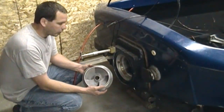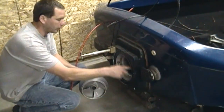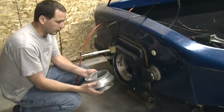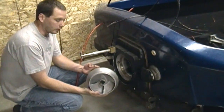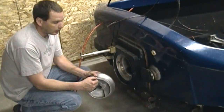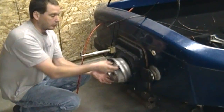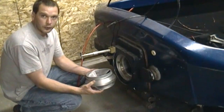And from the last video, a couple quick words on this clearance between this impeller collar and this wear ring. I'm hearing that you can run that quite a bit tighter if you have a racing application. I read the manual over and over and I still come up with 25 thousandths clearance between the collar and the wear ring. If that's centered, it would be 25 thousandths. But if you want it tighter, it sounds like you can run those tighter.